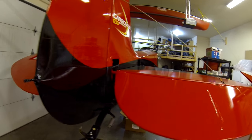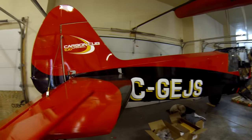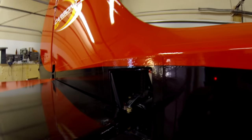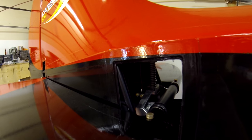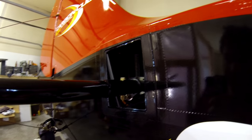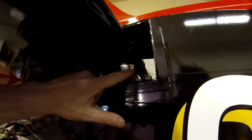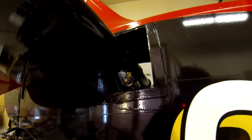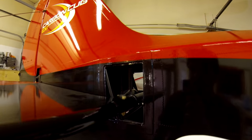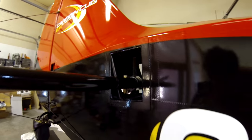The tail light I have to put in — for the most part that's done. All the inspection panels have been finished. I still have the striping to do on this side. This is the EX2 model and it's actually got a little different jack screw setup to give more nose-down trim — my understanding is that the cub runs out of trim when they fix that on this. You'll see the actual spar is above the bracket, not like the EX model. Make sure you put it in properly or else you'll be taking the whole thing apart — ask me how I know. The manual is not up to date for that.